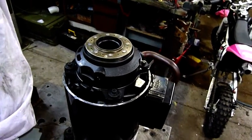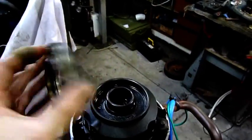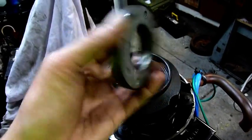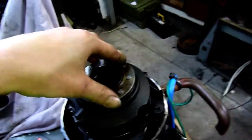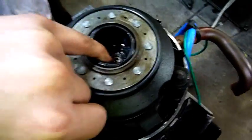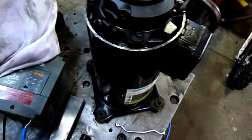That's better. You can see that seal rose up straight away — that's what it's designed to do. It's got a little ring, a compression seal in there. That one's facing up because that's the high pressure side in there; that one's facing down because that's the high pressure side under there. It's just pressure differential that does that — pressure trying to go from high side to low side. That's a thermal valve by the way: if this compressor really overloads and runs too hard and too hot, it will dump pressure out through here via a little plastic tube shooting down into the stator on the low pressure side. That's why you can't really run these till they pop.